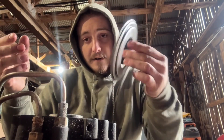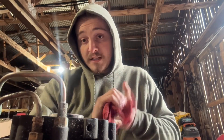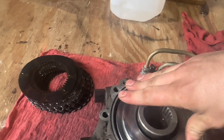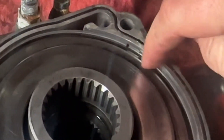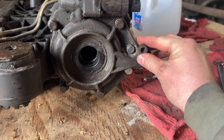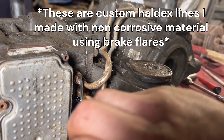Everything should spin nicely once it's set down. Take the top plate, get it cleaned off — the edge that sits up higher goes towards the ceiling. Go ahead and put that plate back on. Just be sure throughout the whole process you didn't get dirt in there. Now all we have left is to put in the clip — put it in on one side first and press it down, with the exit on the small hole. I'm replacing the crappy cap head bolts that constantly strip out with brand new stainless ones with matching washers. Got all the 13mm bolts tightened down and now tightening up the fittings and tubes.